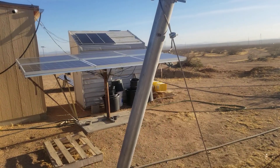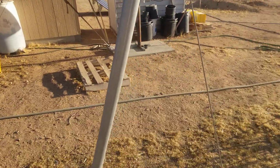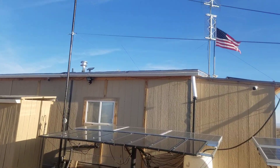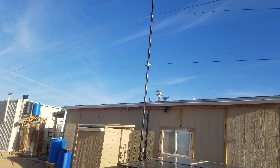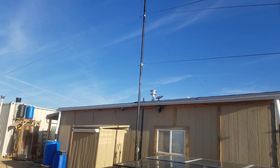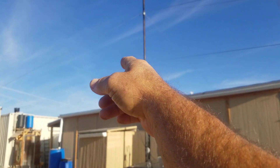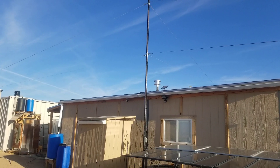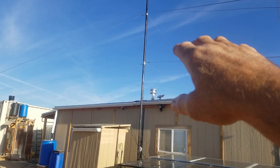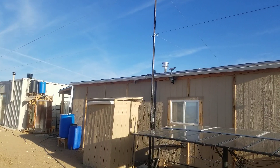The way it's set up gives me a little more leverage — give me a lever and I'll move the earth, right? I've got two of these units, one over there and one over here, and they are all adjustable. The second set of cables is a finer cable because it doesn't take a lot of stress. These weren't even stretched — still tight from when I first put them on. These are here because if you're anchored at the top and anchored at the bottom, you get flex in the center of the mast — a hula-dance belly — and you don't want that because it takes away from the efficiency of the unit. I watched it in the wind, saw where it was flexing, and put that second set in there to keep the hula dance out of the whole system.